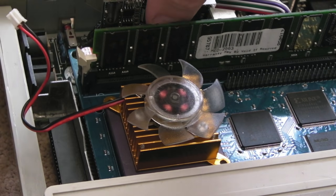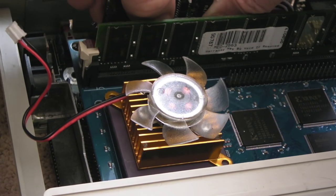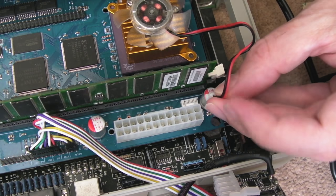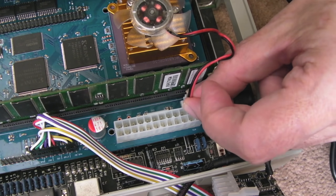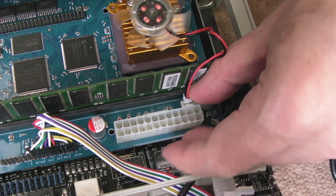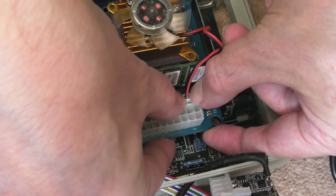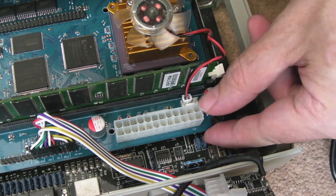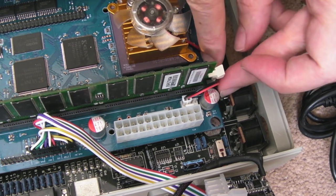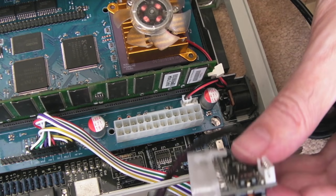Filming from the back of the Falcon here — the right-hand pin is ground, the one next to it is 12 volts. The connector I'm using is a really small JST — perhaps technically not the right type, but it goes on really firmly. Job done. I just need to route this wire down there so it's not going anywhere, and carefully reconnect the power supply — just hold the bottom of the board while I clip that on. That's it.